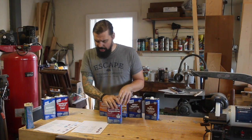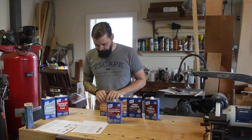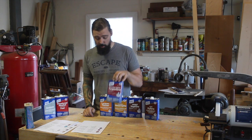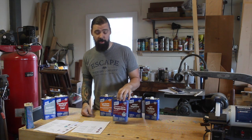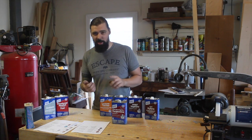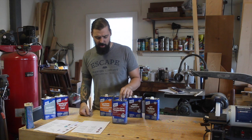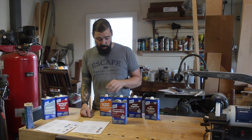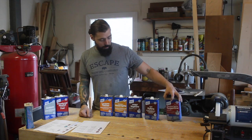The last one on the list is turpentine. It's kind of taken a back seat to mineral spirits as the primary oil-based thinner and solvent and isn't used near as much as it used to be. I'm a rarity because I use this more than mineral spirits. I don't do a whole lot of thinning with it — what I use it for is cleaning the resin and pitch off my blades and cutting edges. Partially because I don't mind the smell — I kind of like it — and also because if it's made from resin, it's probably the best thing for dissolving resin.